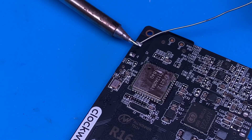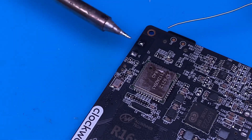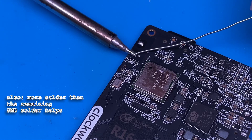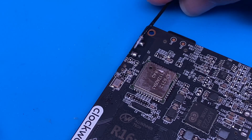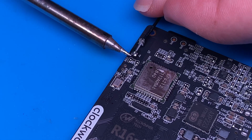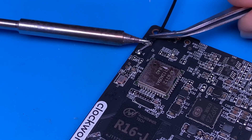Next I'm going to re-solder the pads — just remove the old solder and add some new, so we have a tiny dot of solder on each. The reason I prefer to use new solder is because it has flux in it, which makes it easier to solder the cable later. Now to the cable: I'm going to solder the tip first. I heat this pad, push the tip into it and let it cool. Then push down the strands and solder them into the other pad — not with a finger because it's going to get hot.